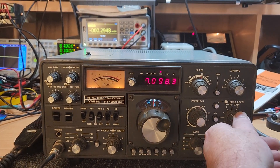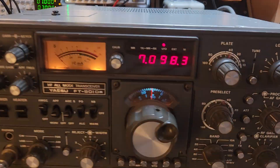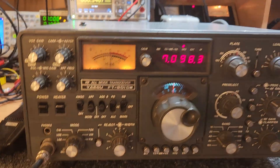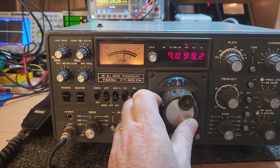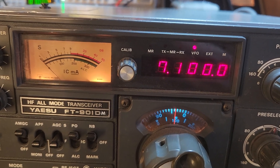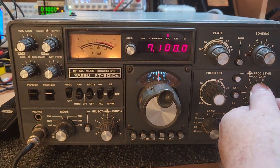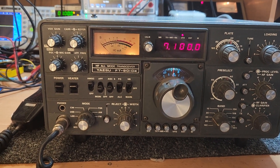Let's make sure it's actually got some noise. Let me just turn off my little test radio over there and we'll generate some signal on about 7.1 — and we've got plenty of signal there, so that's good. There we go, 7.1, and let's take that right down. Oh wow, actually that's nice — 0.5 microvolts and it's hearing okay. I can hear that quite nicely.